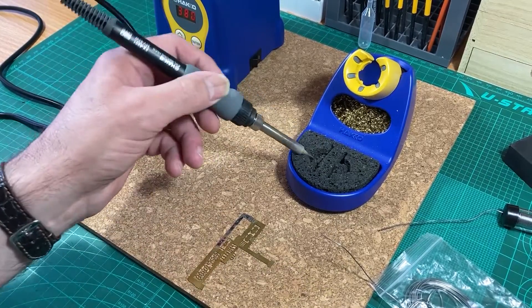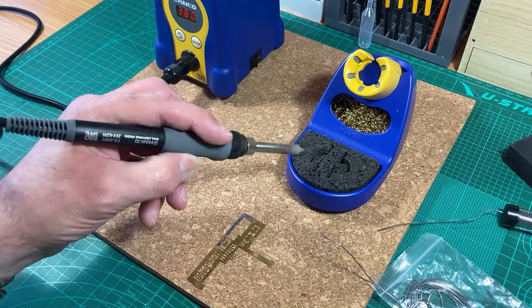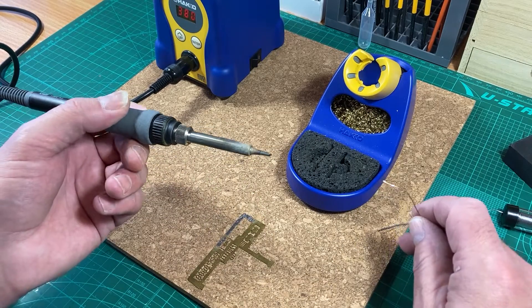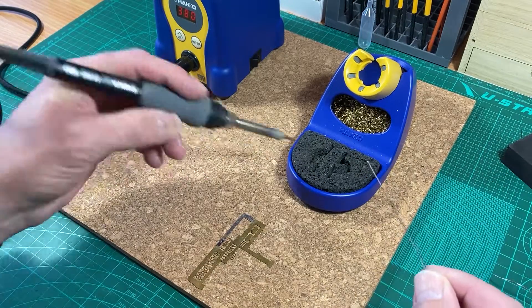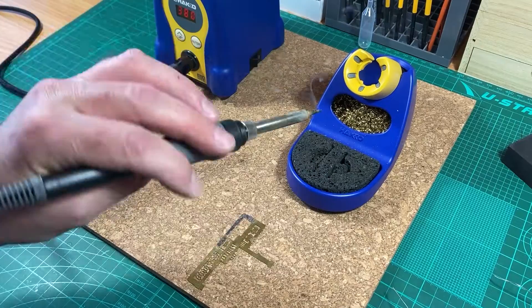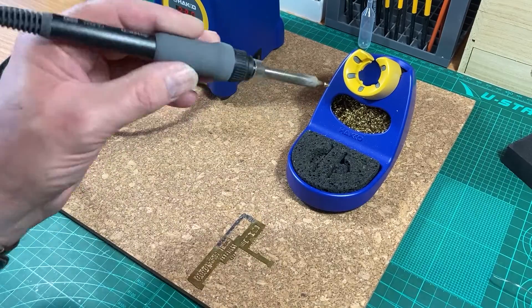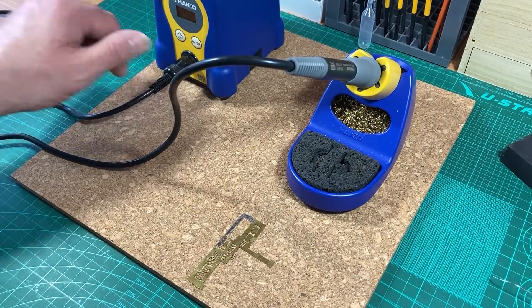So that's the basics of what I do — I'm not saying it's the only or best way, but it works for me. Eventually the plating on the tip will wear off, but if you keep it clean, keep it covered, and keep the temperature high only when you're using it, you should extend the life of the tip. When finished soldering, cover all the plated area with solder and move it around so it flows all around. Then you can either reduce to standby temperature if coming back shortly, or put it in the holder and switch off. I hope that helps answer any questions.